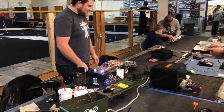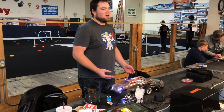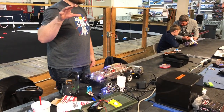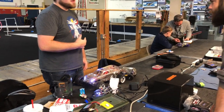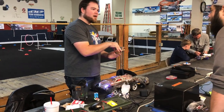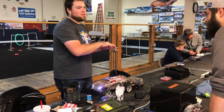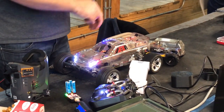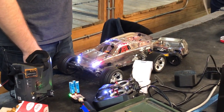With the way it's actually working, it's not generating the LEDs from code — it's just playing a pattern. It has a frame-by-frame animation that I drew in a program. It spits out a header file. You add the header file to the pattern player sketch in your Arduino, then just type in the name of the header file. You can load multiple headers in there and just change the name to have it play whichever one you want.